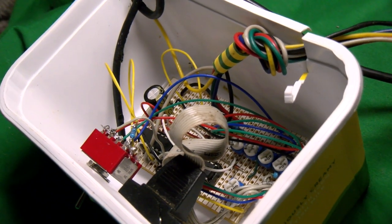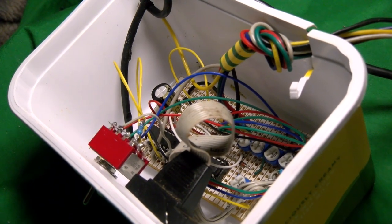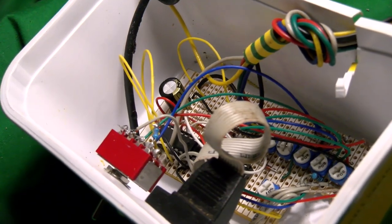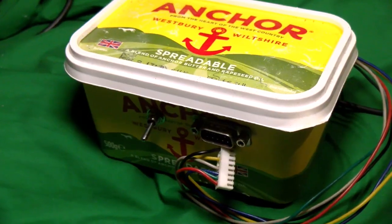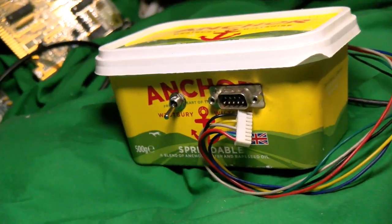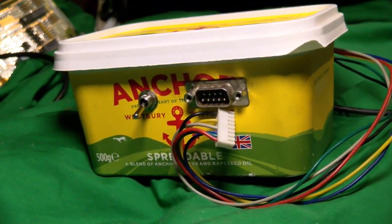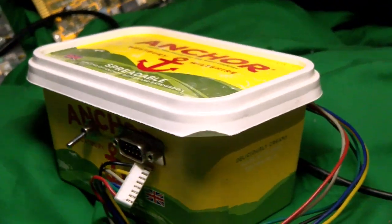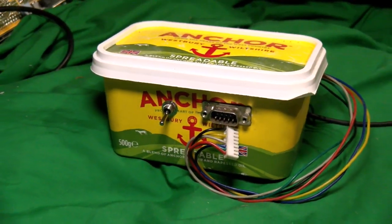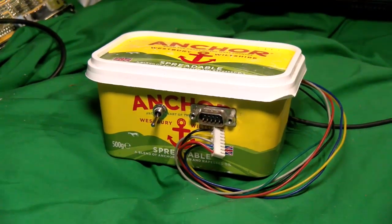Something like that. In my case, I'm using one of the otherwise unused exclusive OR gates as a NOT gate to optionally reverse the H-sync polarity. You see, the CGA card I have actually outputs negative H-sync, or would that be normally high instead of normally low, where CGA usually has positive sync for both H and V. As we're XORing to get composite sync, we need the polarities to be the same.